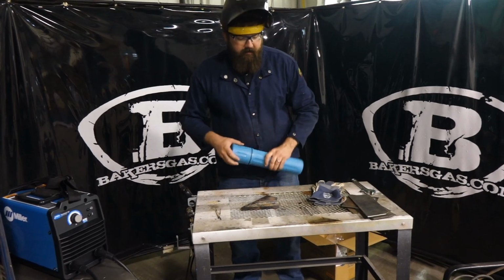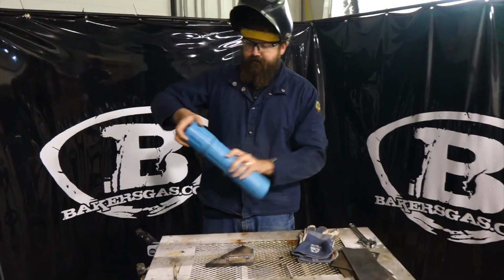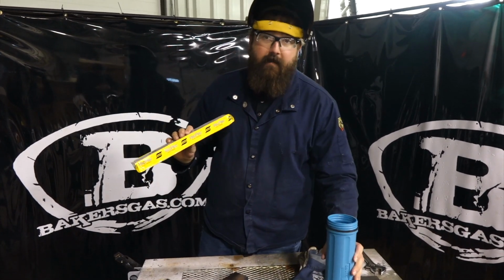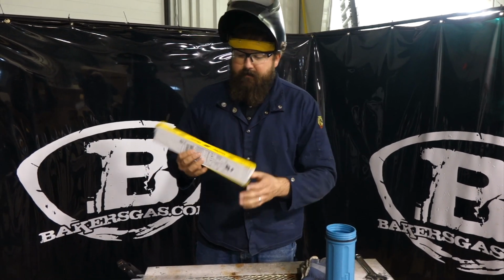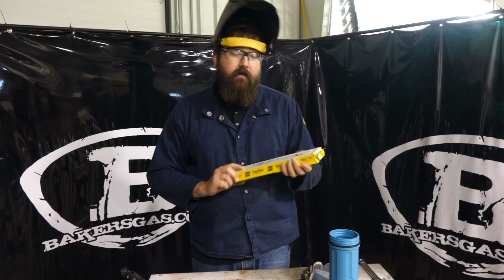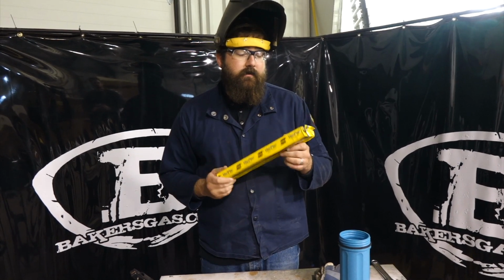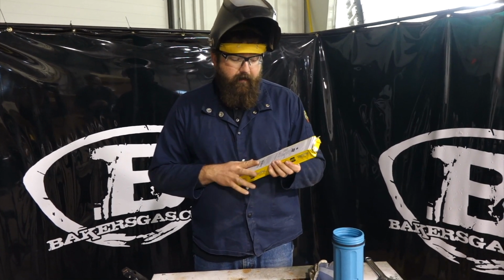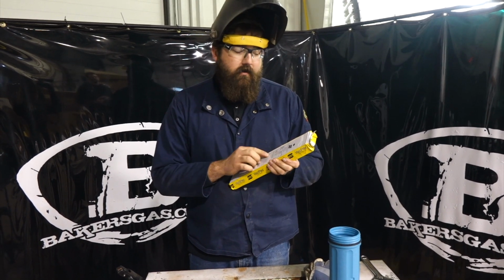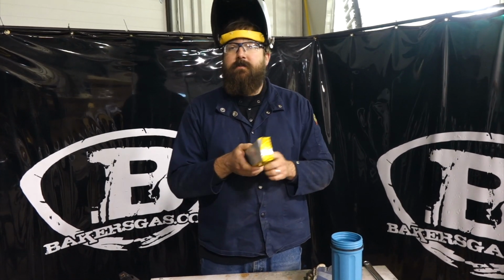We're here today to talk about something new that ESAB came out with. So here in my rod guard container, I have what they just introduced, called ESAB VacPac electrodes. VacPac is a 100% hermetically sealed package, 4 pounds of 7018-1H4R. It is a premium electrode, so low hydrogen. It's a 4-pound package. You can get it in 3/32, 1/8 inch, 5/32. Also, you can buy 24-pound packages of it, but those come with 6 of these packages in a box.